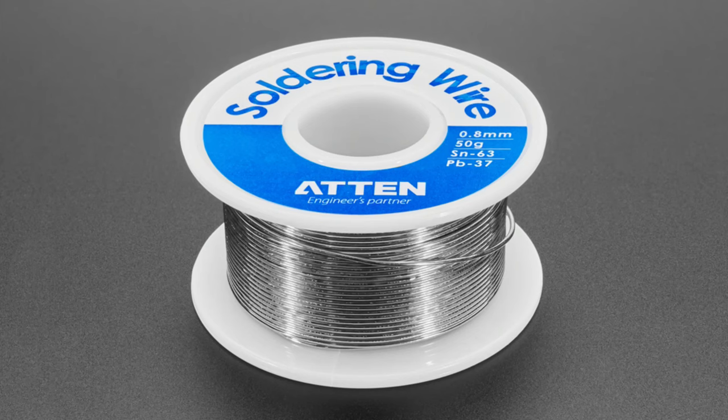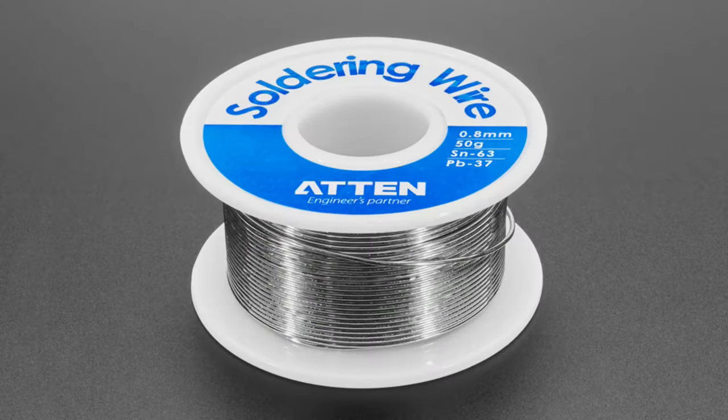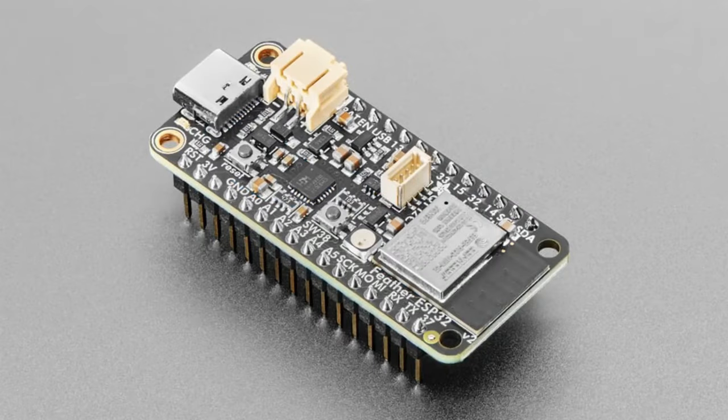I love this series of solder. I've been using it plenty. Just remember, it's not RoHS, and it never will be. It has lead in it, so use it where you definitely need lead. We also have lead-free solder, of course, and it has rosin flux in it. So great for kits. This is a thicker wire, so good for through-hole soldering. We'll make it a lot faster.